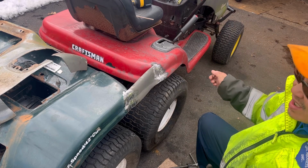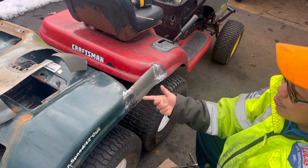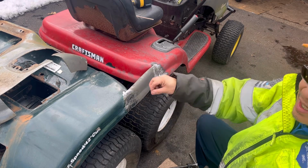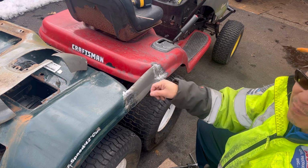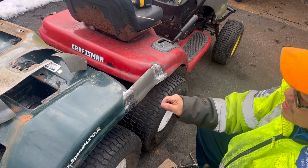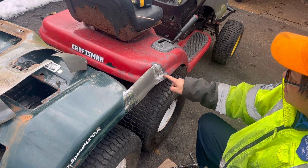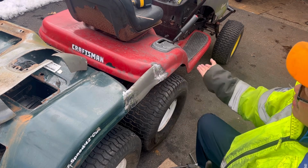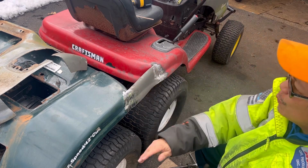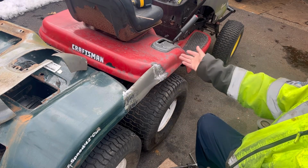And also I had the setting on too high a power, so when I got to one place it would burn a hole right through it. Then I would lessen it and try to fill the hole with metal. And that's why you can see so many little dots, because there's so many holes and I tried to fill them. There was actually a hole here that somebody drilled and I filled it. It was pretty good. So after you grind it a little bit, you can put Bondo if you want, but I'm just going to spray over it with some primer and the desert sand color.